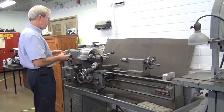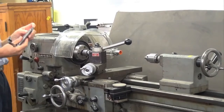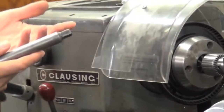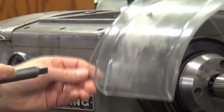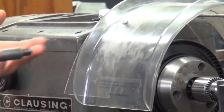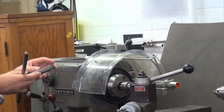The best practice associated with the chuck key — this chuck is not something that I would use this on, but if you're using it on a chuck, you want to have a spring-loaded chuck wrench. This one is a standard chuck wrench — on a lathe it's called a wrench, on a drill press it would be the key. They make spring-loaded chuck wrenches so that it can't be accidentally or inadvertently left in the chuck, which would create a serious hazard if you started that machine with it left in there. With a spring-loaded chuck wrench on a lathe, that cannot happen.